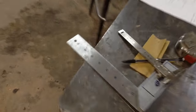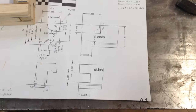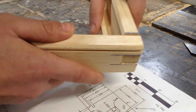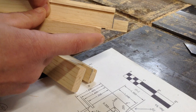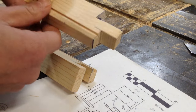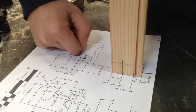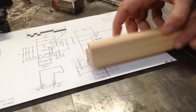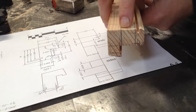These are all the blanks I'm working with, because the part that was going to be more difficult — the mortise and tenons — I did the next day. The reason these are a little bit of a pain is you now have an odd-shaped piece of lumber. It's not centered, so you can't just flip the piece and cut identically like you would for a centered mortise and tenon on a door. You're going to have four setups to cut: two setups to cut the mortise, and then two setups to cut the tenon.